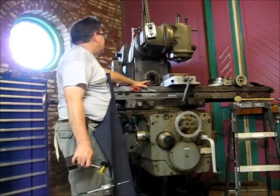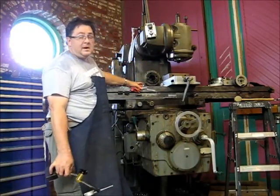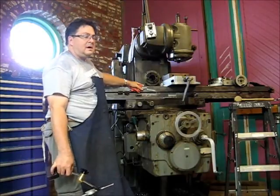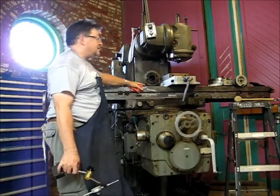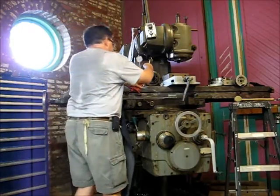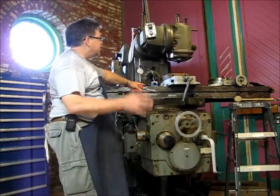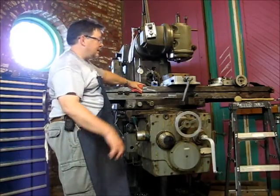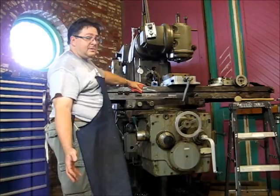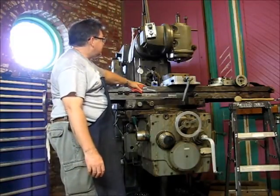If you take the scales and match them up and line up your marks where they need to be, you're right on the money. These types of machines are so well made, at such a high level of quality compared to your typical Bridgeport clone, that things like the scales actually work — a lot of machines those are just a suggestion, but here they work really well. I just wanted to do a quick video to show you the tramming process on a machine like this — a little different than doing it on a Bridgeport where you sweep the spindle. Anyway, thanks for watching.